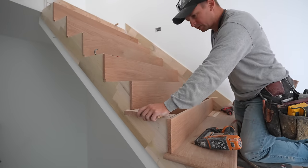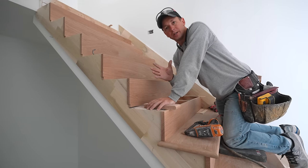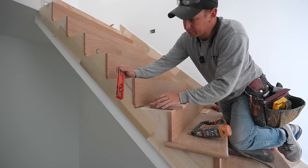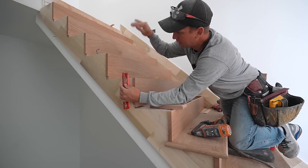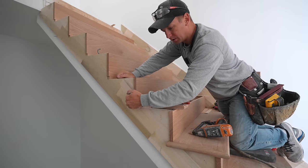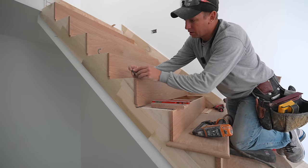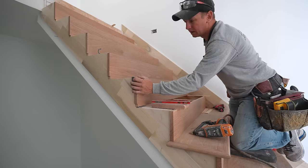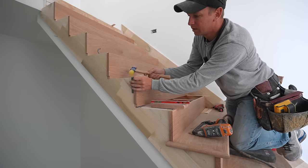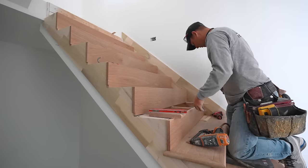The first thing I'm going to do is put a brad nail down here. One thing I didn't show in the previous video is that whenever I nail on this skirt board, I go back through after and make sure everything is plumb — that's very important because we want our quarter inch reveal to be exactly the same. After I put that bottom nail in, I'll take my little gauge and check the top as well. Using your finger to feel that connection — perfectly flush — and then I can finish nailing: top, middle.